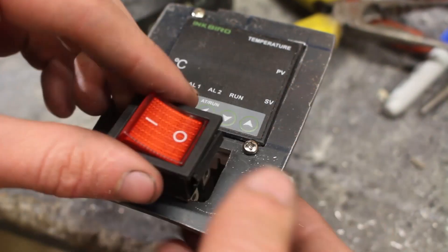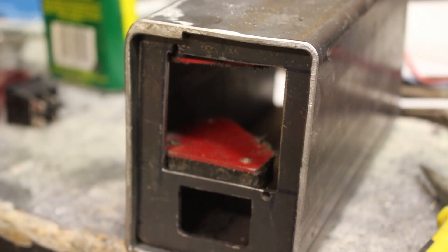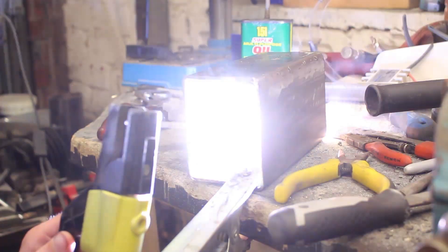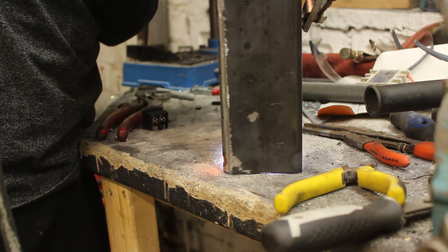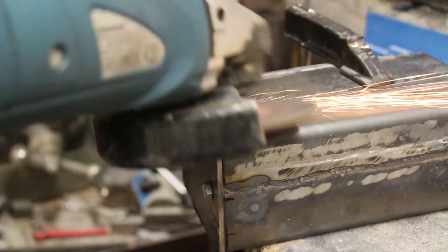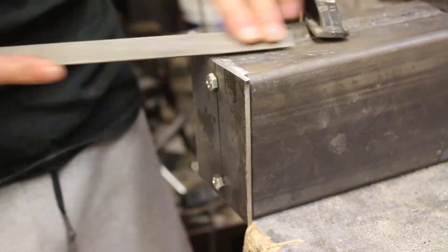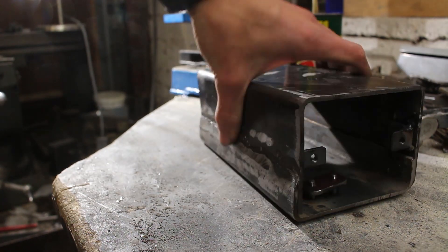I also cut out a square for this on-and-off switch which is just going to control the power to the whole circuit and this can take 20 amps so it should be fine. I held that door panel in place slightly recessed from the enclosure box and then tack welded it in place from the back using the stick welder. I also welded on some tabs on the back which I'd threaded to M6 — that's how I'm going to secure the back of the electronics enclosure. The back consists of another piece of 4mm sheet steel that I secure on and then grind flush with the angle grinder. This is what the electronics enclosure looks like once it's complete — pretty simple but solid metal so it should be quite robust.